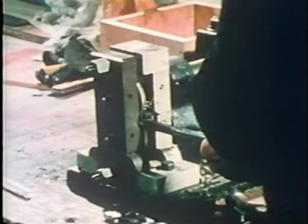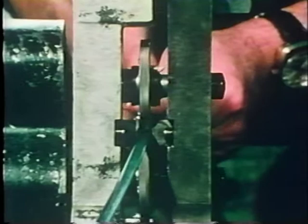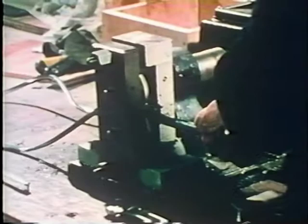Starting with the lead ingots from a lead smelter, the castings are a special shape which are designed to go into this electrically driven mill. On the mill end, by changing the milling wheels or the dies themselves, I can vary the sizes of the lead that I produce quite considerably.